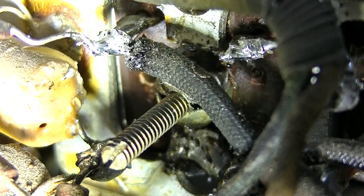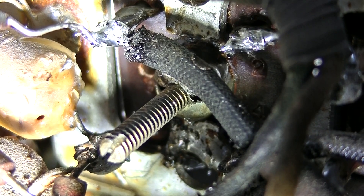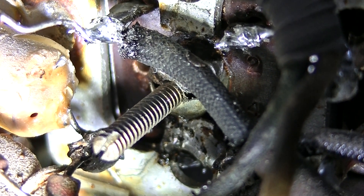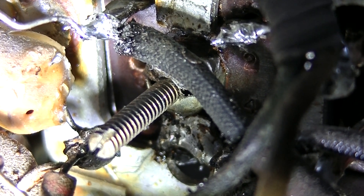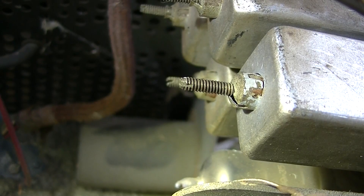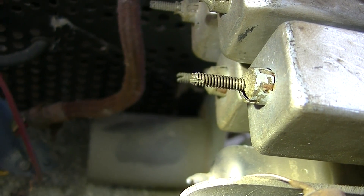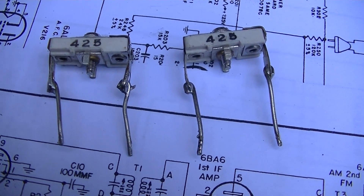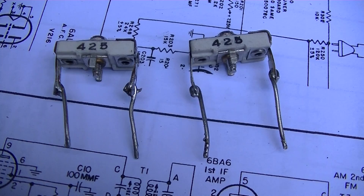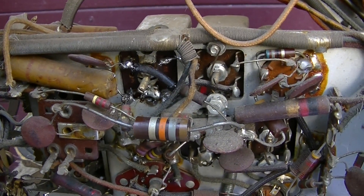I need to go back in about 2 millimeters and I'll be in the right spot. Ideally when you get silver mica disease, you never want to turn the cores because they were presumably in the place they should be when the thing was designed or originally aligned. We want to try and get the cores back as close as possible and then get the right capacitors. Same thing with the top — I didn't move it much but you can see where it's shiny, it needs to go down.